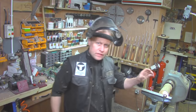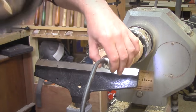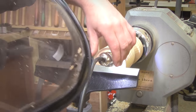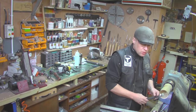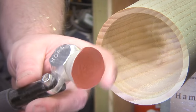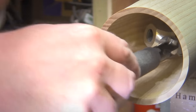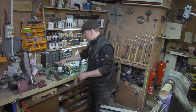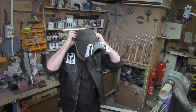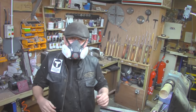I'm quite near the bottom of this piece now. I can't see all the way down, so I've rigged up this Draper angle-poise magnetic lamp to hopefully help me see the very bottom. To help me sand the inside I'm going to use the Simon Hope sander with his little 25mm or one-inch sanding head so I can get right down there and keep my fingers safe. I've got the extractor running and the air filter going, and I'm going to make sure I look after my lungs.